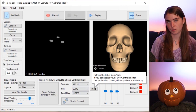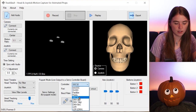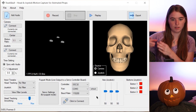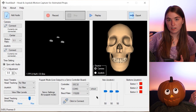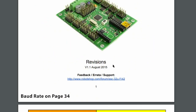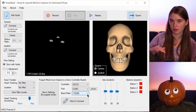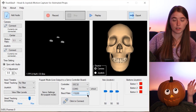The first thing I'm going to do is set up the controller. I'm using the exact same controller box from my original tutorial — it's an SSC32, connected to COM3. I want to talk about the baud rate real quick because I've had a couple questions on that. When you first buy an SSC32U, it comes preset with a baud rate of 9,600 — that is the default. You can change that on the board using a button between two LEDs labeled A and B. I'll include a link to the manual. I've changed my baud rate to the max, because lower baud rates can cause issues with servo movement, especially with more servos. I'm working with six servos here.